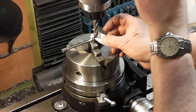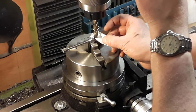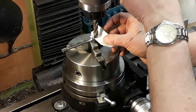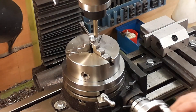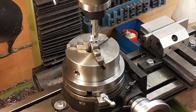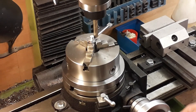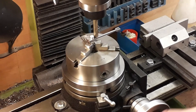I'm also going to put a little step, so I'm using cigarette paper just to bring the tool down. Once you know it's gone tight, you're just touching the workpiece and we can zero. I'm just going to take a little bit — just to leave us probably a couple of thou, maybe five thou — just a little boss where it's running on the crank web. It'll just run against that instead of the whole big end. Turn it right around, to a depth of probably about five thou.